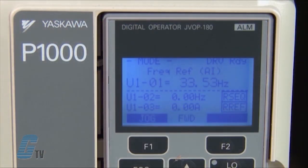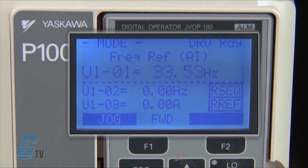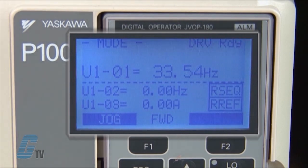The P-1000 has an easy to read LCD screen. It displays the operation mode menu in the upper left corner and the mode display in the upper right hand corner, along with an indicator to show when the drive is ready to run. The main display shows specific data and operation data. There is a frequency reference assignment on top, and just below the dotted line shows where the run command is supplied from, which could indicate an operator keypad or a remote source. The bottom line in the center of the display has the forward and reverse indicator. The function keys on both sides of the display indicate what the function of the F-1 and F-2 keys are.